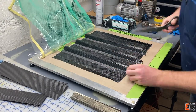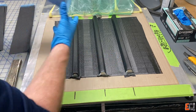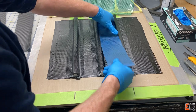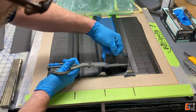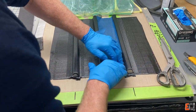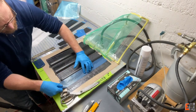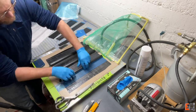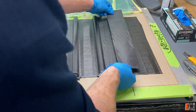Finish with the debulk, cleaning up a little bit of messy ends on that uni. And the final ply is another RC200, 200 gram twill, which I'm going to attempt to put in, keeping the diagonal ribbon on the twill relatively consistent. If you're very careful with prepreg, you can line the pieces of twill up so that it looks almost like one piece,